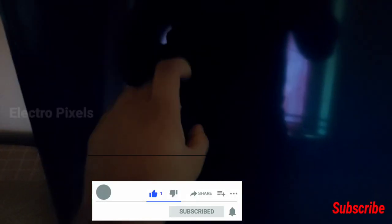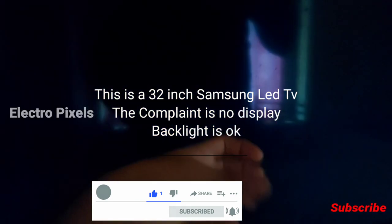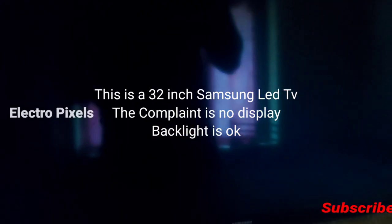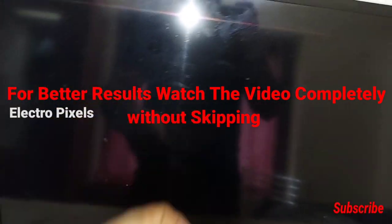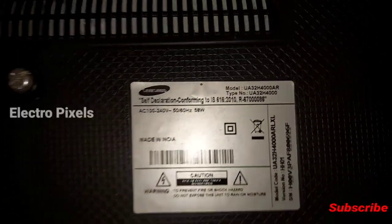This is a 32 inch Samsung LED TV. Here the complaint is with the panel. Here you can see the backlight is okay. So let's check the panel. Here you can see the backlight clearly. So it's confirmed that the complaint is with the panel or maybe with the motherboard.